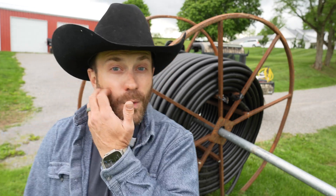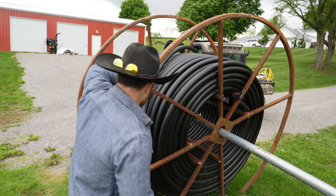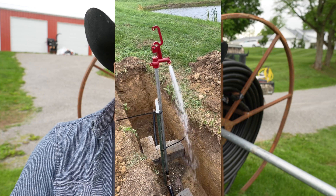When I did the calculations — with help from Rural Power Systems, verified with Google — for 1,000 to 1,500-foot runs like we're doing with our permanent trenched water system, we need inch-and-a-half diameter pipe. When you factor in friction losses, if your pipe diameter is too small you'll see a major pressure drop. The calculations said we needed inch-and-a-quarter minimum; the next size up I could get was inch-and-a-half, and even 1,500 feet away with 50 feet of elevation gain, we get pretty good pressure. Do your engineering, make sure you've got all your valves, don't cheap out on components — get brass connectors, get good quality pipe — because once it's in the ground, the last thing you want is to dig it back up.